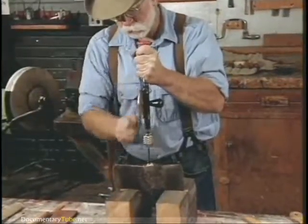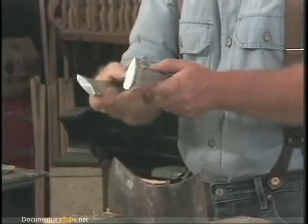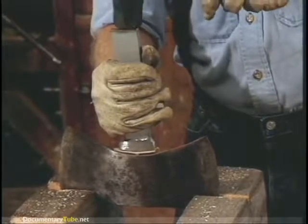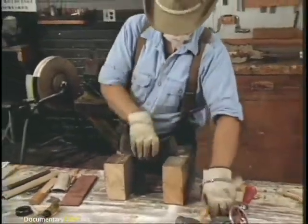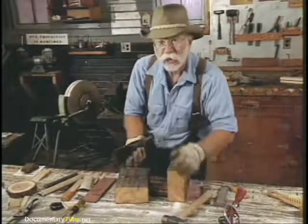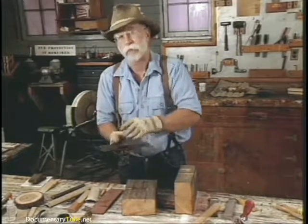Just drill a series of holes down through it. The tools to use on this are drifts or swedges. This one's for a single bit — you can see the shape of it — and here's a double bit. Put it right on the top like this and take a hand sledge, about a two pound, and start to drive it out. You'll read in some old books that another way to get the handle out is to put it in a fire and burn it out — never attempt that. There's too much risk of drawing the temper or re-tempering the edges.